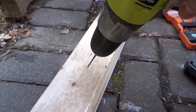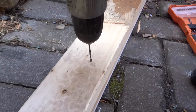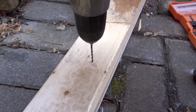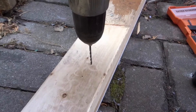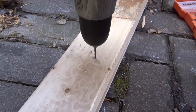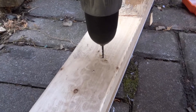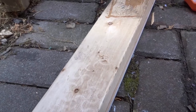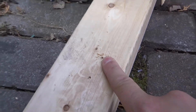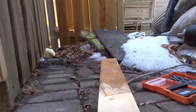It's very easy to do. You want to pick your spot that you want to drill your pilot hole, which will end up being the spot that the screw is secured or fastened into. You want to drill down a little bit — you don't need to go the entire length of the screw, just a little bit. So I'm going to drill down just like that, pull it out, and go a little bit further. So I've drilled down over here — that is my pilot hole. You can see it's a very very small hole, and that's all that you'll need.